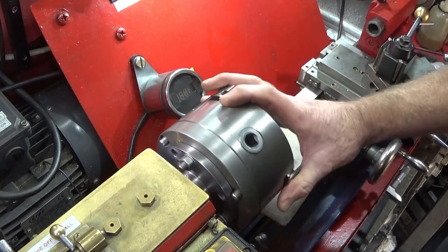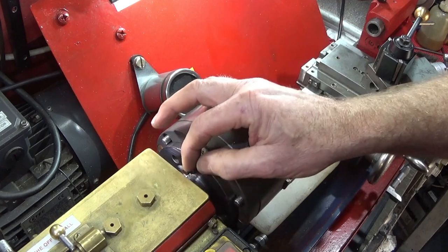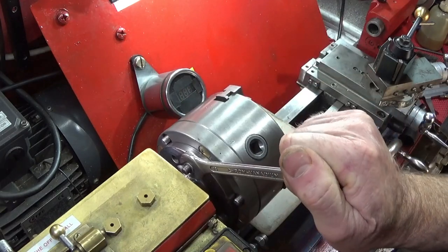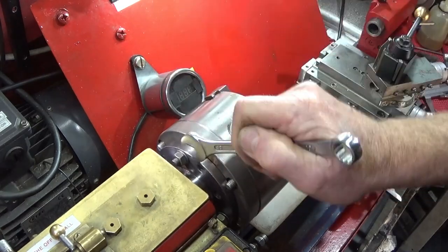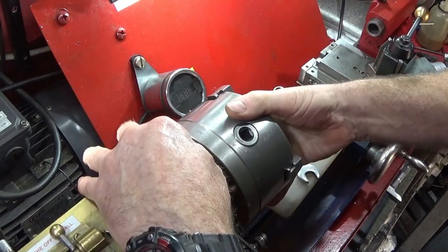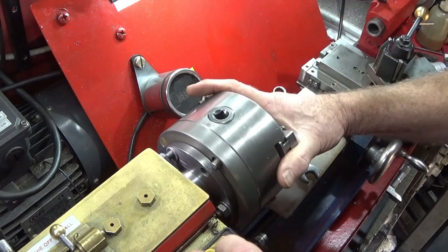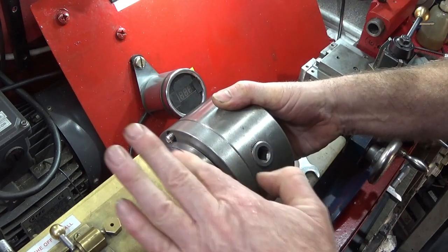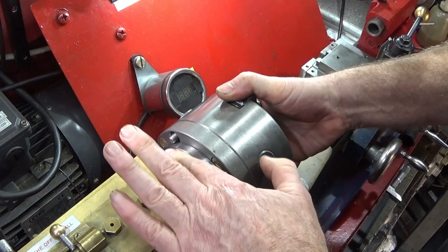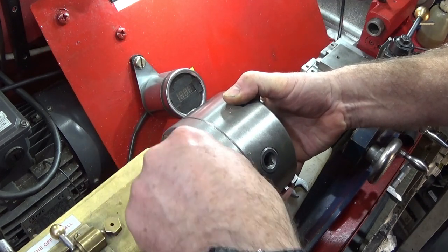That's what my 125mm chuck looks like on the lathe with the studs. There's enough room to get the nut off the back, and the threads on most of these chucks are 8mm. To loosen this one I can hold my pulley wheel and loosen all of them like that, then it's simply a case of spinning those nuts off with the washer. I loosen all of them to the full length first, and always have something over the ways to protect the lathe. When it's loosened I can pull the chuck forward and take those nuts off with the washer.